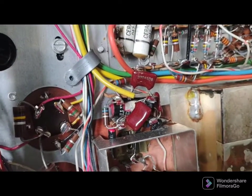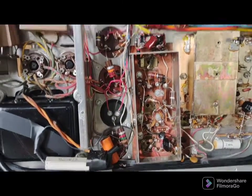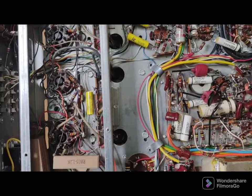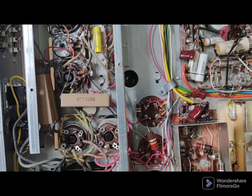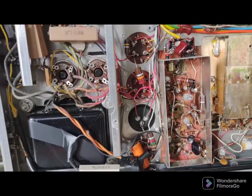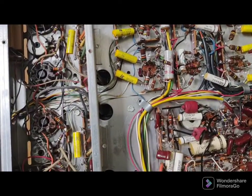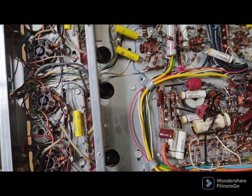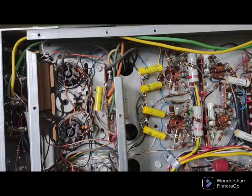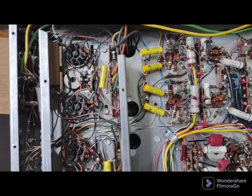So what's the moral of the story? These things work great, but all these pieces in here are literally a time bomb — they're going to fail; they're 60 years old. When you take the dive into vintage, especially vintage tube audio, this is going to happen. And even solid state can have the same issues. I did a partial restoration but didn't replace everything, because I either didn't have time or I focused on the ones that would cause collateral damage if they failed.